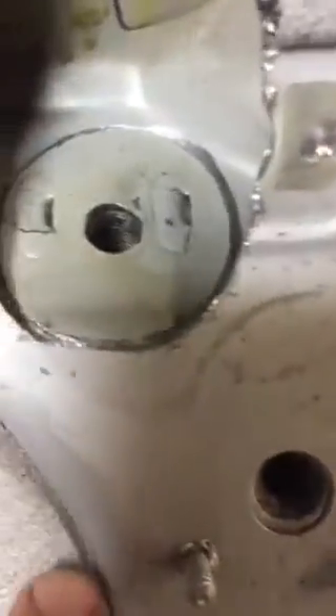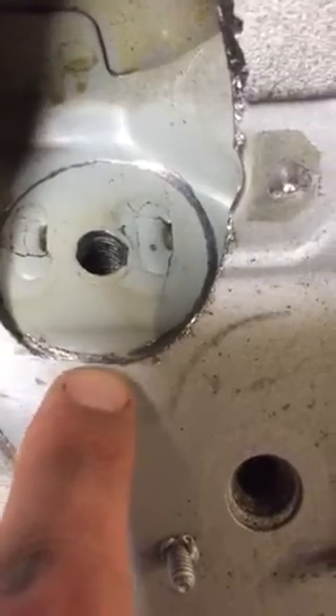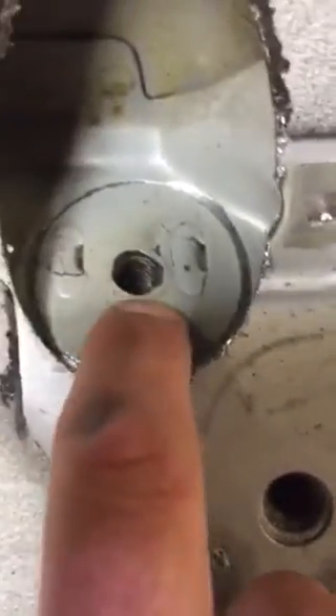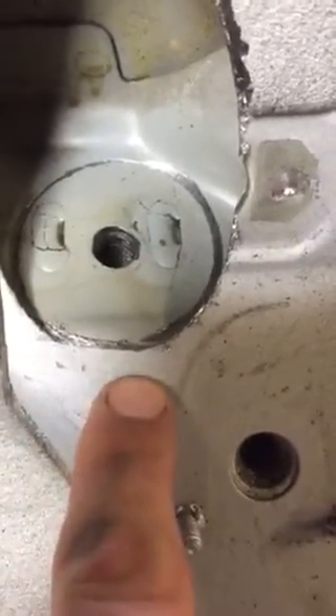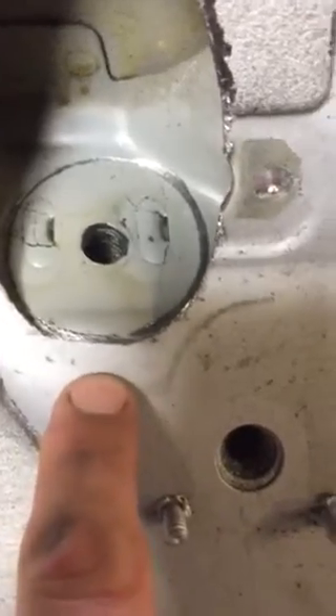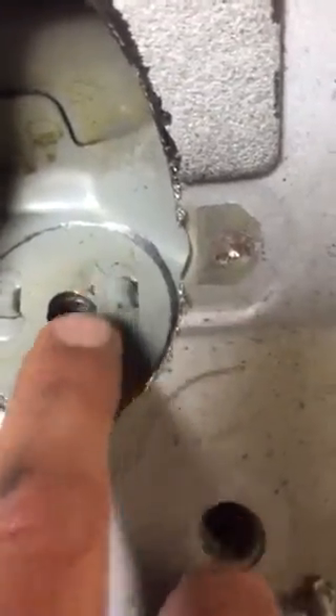As I run this demonstration, I want you to pay attention to how the top of the RACP moves relative to the floor skin. I also want you to pay attention to the cracks here — you can see we have a number of cracks, and depending on which direction I move this, you're going to see how these cracks open and close.